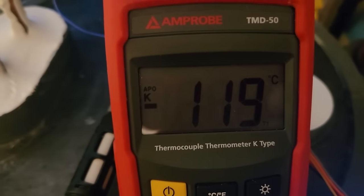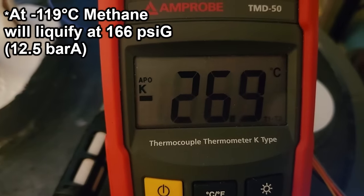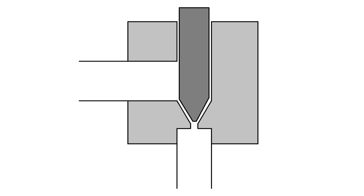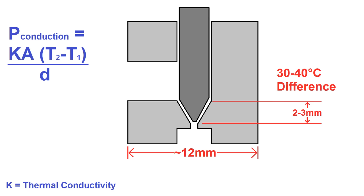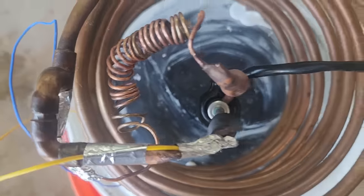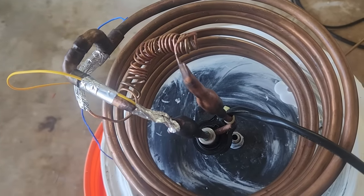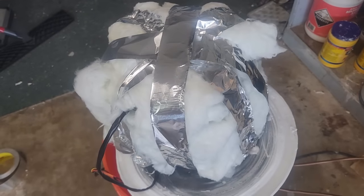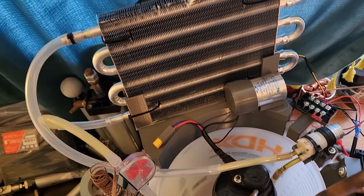By making those changes, I managed to get to minus 119°C with pure ethylene — not too bad for a single-stage system. That's cold enough to liquefy methane under pressure, but not yet enough to liquefy nitrogen. I suspected a lot of my loss was coming from thermal conduction in the valve body itself: inside the EEV the entire temperature drop occurred over just a few millimeters, and the valve body had a relatively large cross-sectional area. Even though the body was stainless steel, which has low thermal conductivity, the combination of large area and short distance caused substantial losses. To solve this, I placed a 1 mm inner diameter, 1-meter-long capillary in line with the EEV so the temperature drop would spread over a much longer distance, reducing conduction loss. I also wrapped the entire coil with glass wool and replaced the tiny water radiator with a much larger one to help reach a lower temperature under heavy load.